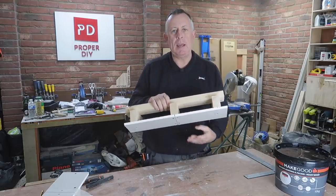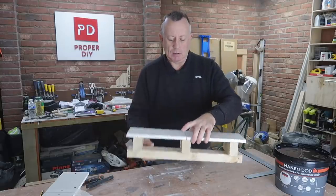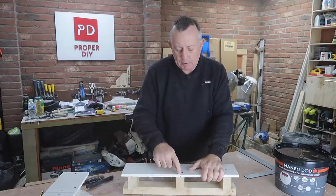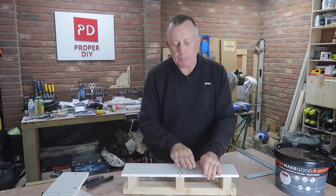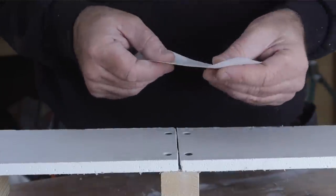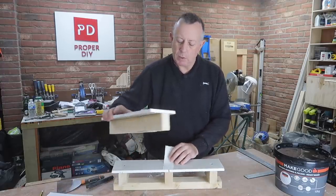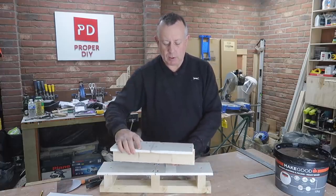The second joint is at the ends of the 8x4 sheet, or any cut ends - you basically end up with a butt joint. The butt joint runs parallel to one of the joists so you've got quite a good fix on either side, meaning even with a gap there's no differential movement between the two. But it is a little bit more difficult to tape and hide because there's no taper and no recess. For this joint I've decided to use paper tape rather than mesh - it's a bit thinner, which means my build-up can be thinner. So those are the two types of joints and two different processes.